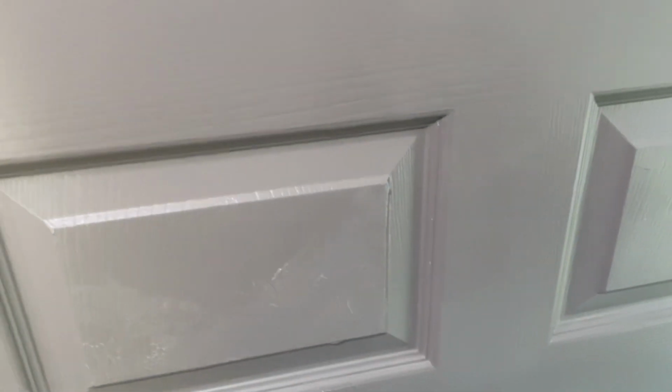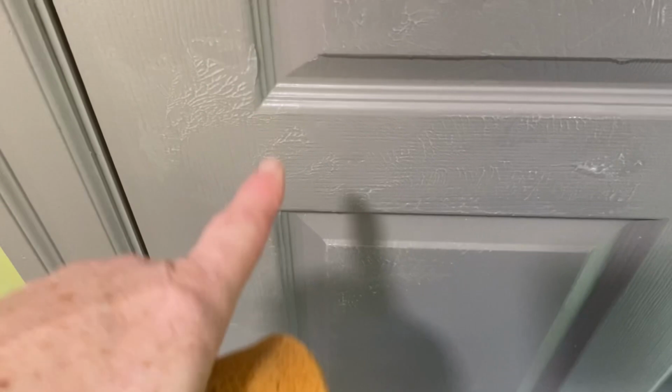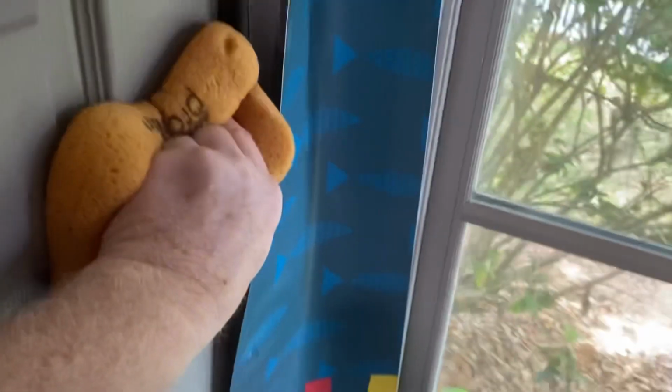Love it. Believe it or not, I'm going to show you one of the biggest pieces of advice I could give to new installers. You see this? You leave this on a wall or a door, you will never get a job again from these people. This is very difficult to clean off once it solidifies. And plus, it's such an oversight on the installer's part to leave paste on surrounding trim. Just clean it off when it's wet. This way you won't have any liability issues.